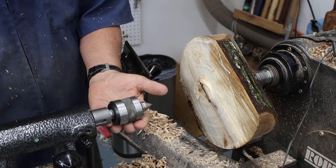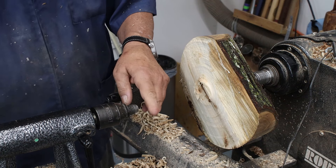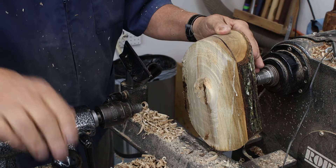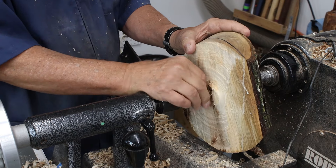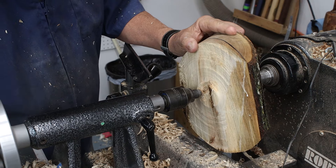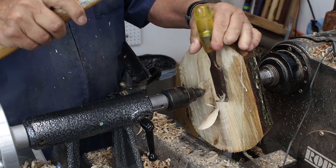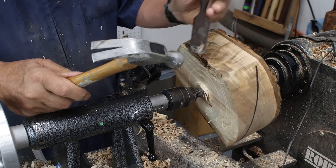I'm going to replace my live center, putting the cup center back in. I took a wood chisel and removed most of that wood — it was at a really bad angle. I'm going to readjust just a little bit, but I don't want to do this too much because I don't want to remove too much wood. I'm kind of bound by that in order to keep these high and low points level. Let me take that off so it doesn't fly and smack me.